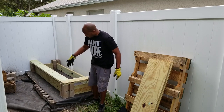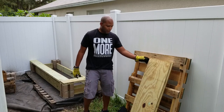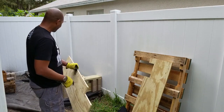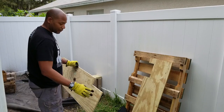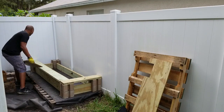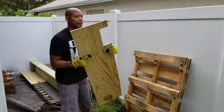We put those together — that's going to hold that joint. We're going to glue it down and screw it down to get it in there. We also did some notches in our deck because it's going to be our platform to walk on, so we had to notch out for the block. Let's get those in and cut these notches out.